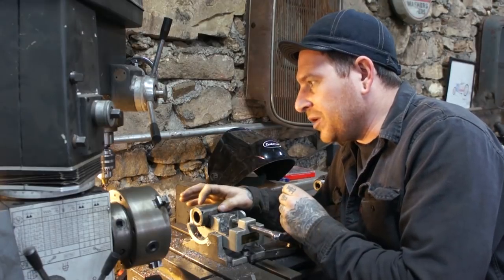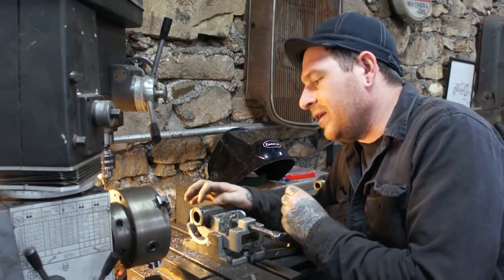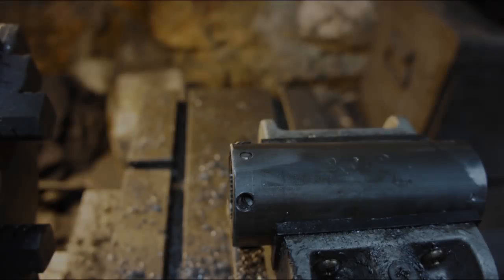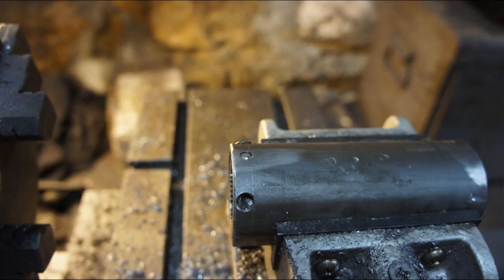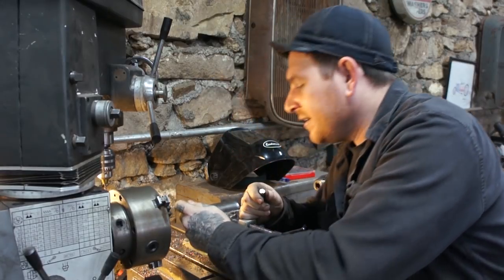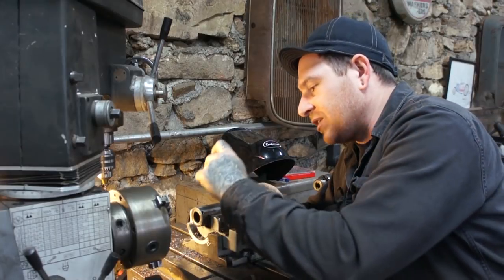And what we did is we milled a hole down in that was basically the same size as the pin, so we could drop it down, and I made it just a little bit shorter. So I can pull this out, and we'll get a shot of how it's sitting in there. But there's this little tiny pin here that goes through the tubing and goes about halfway into the depth of this spline section.